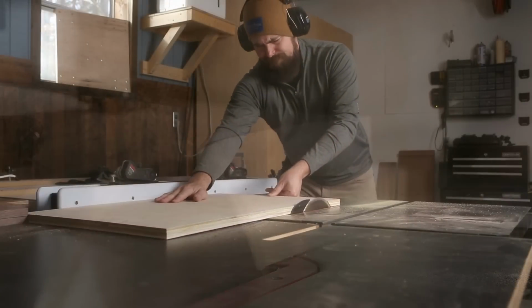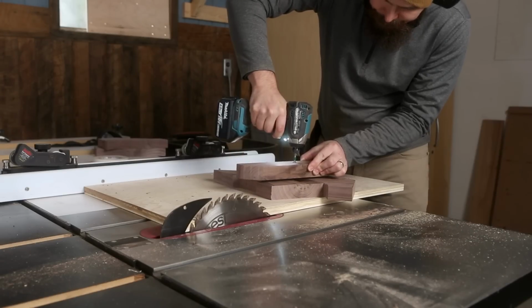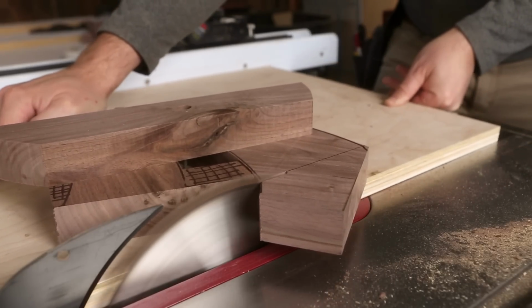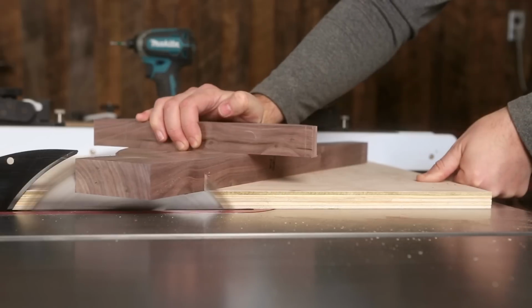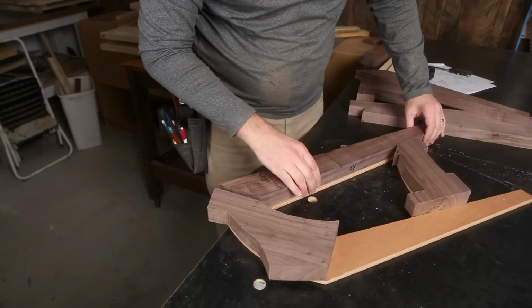without any gaps. A basic plywood sled is a really valuable tool. You can just cut a fresh edge whenever you need to use it again and know that's right where your cut line is. Double-sided tape works great to hold things down, and for extra clamping force, you can screw in a bridge piece like this using an offcut or another component as support.